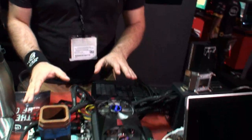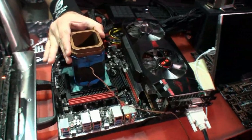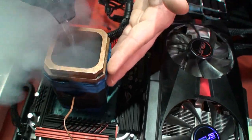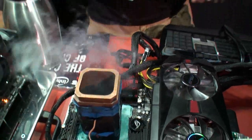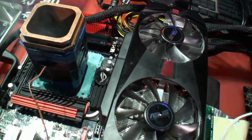We also have the same motherboard configuration, but we're running a 2600K. We've got the copper liquid nitrogen cooling container on here — we simply pour the liquid nitrogen directly in and that removes the heat generated by overclocking. Temperatures for this 2600K could be about minus 40 degrees Celsius, and we're going to clock it up to about 5.7 gigahertz with four cores and eight threads enabled.